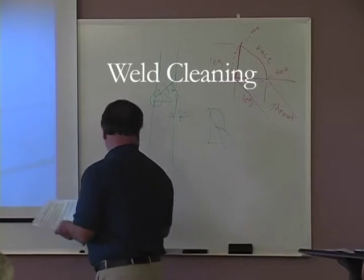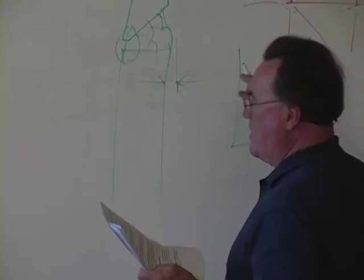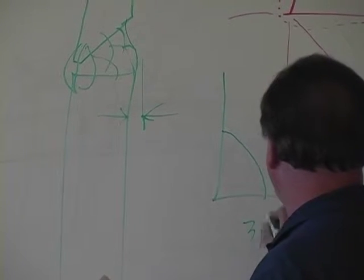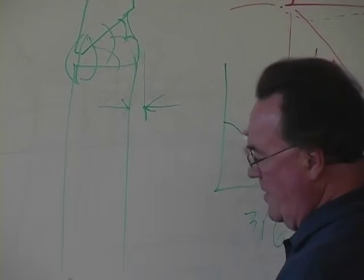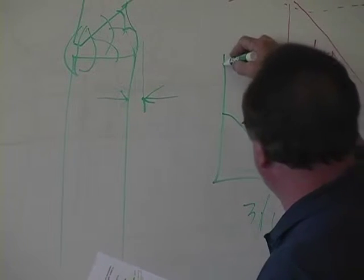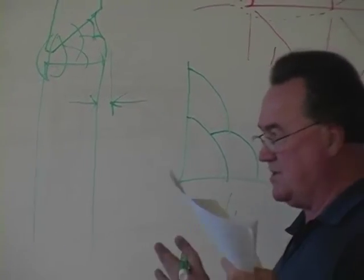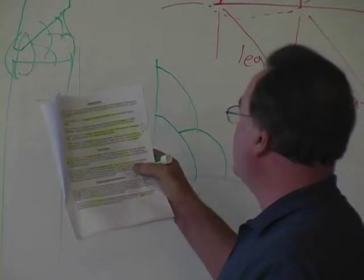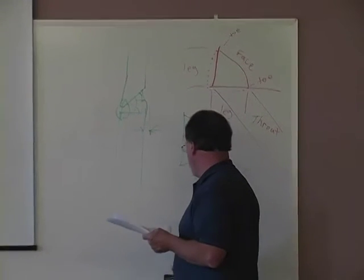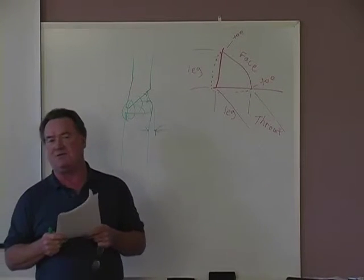Weld cleaning — in-process welding. You'll run into this when they're welding girders to bearing plates, which typically takes three passes. Make sure when they run that first pass and they're getting about a 3/16ths weld that needs to be 5/16ths — make sure it's clean. Right here it says not only remove the slag, but it also needs to be brushed clean before they apply the next pass. And when they get finished, the biggest problem is on SIP welding — slag shall be removed and the weld cleaned by brushing. You cannot inspect the weld if it still has slag on it. You don't want these SIP welds to fail before the concrete sets up.